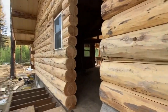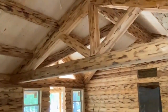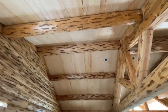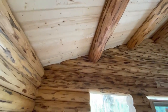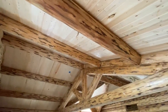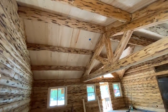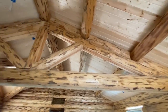Let's get a different view of the front from this angle — isn't that pretty? You look through that truss right there and look into the truss in the front. These beams are massive, bigger than they look. I think that beam above me is a good 14 inches. Engineering would only call for a 10-inch log, so most of our beams are going to be oversized for what you actually need. The truss material is also oversized — we don't need material that big in that truss, but we do it anyway.